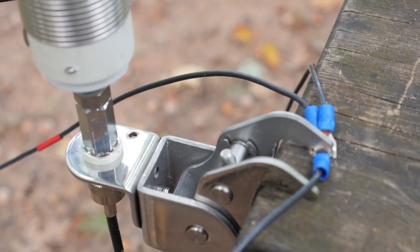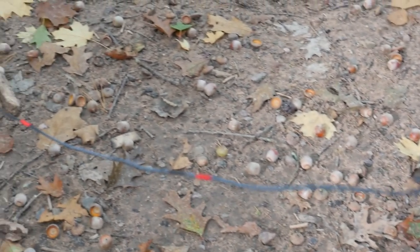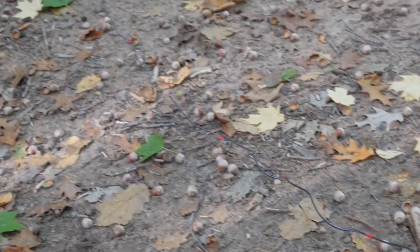The Silver Bullet ideally works with three ground radials of about 32 feet in length. A single radial is not going to cut it with this antenna. When I attach just one radial, I really can't get the SWR down below 5.1. When I add two radials it drops, and then when I add three it drops a little bit more. With the 32-foot length, it works great on the 80 and 40-meter bands, but 32 feet is going to be too long for 20 meters. What I end up doing is winding my radial up to about half that length, and then I can get the SWR down much lower. So it's a little bit of a process for tuning and adjustments to find that sweet spot.